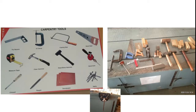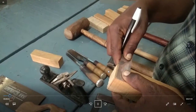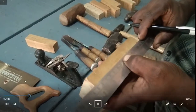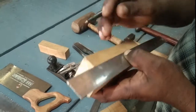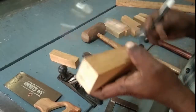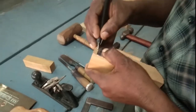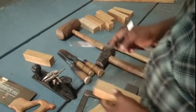For marking the wooden workpiece, the operator places a steel rule and measures the flat side of the wooden piece, marking it with a pen or pencil. He makes dimensions on the lengthwise side as well and draws lines according to the requirement, customer drawing, or standard descriptions available in wooden standard books. From these he gets the dimensions and marks them on the respective workpiece with the aid of a steel rule and pen or pencil.